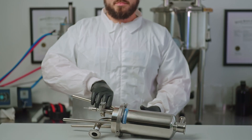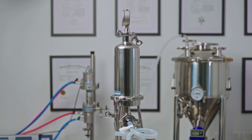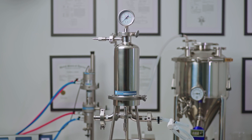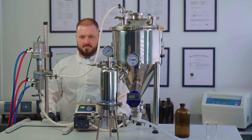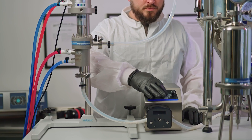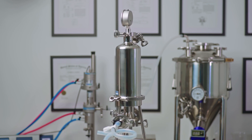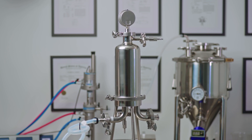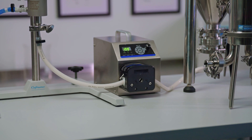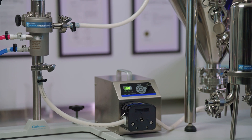In this video we are going to illustrate the procedure for assembling the industrial Sonomechanics large-capacity inline filtration unit as well as filtering a nanostabilizer LSO based nanoemulsion. Filtration through a hydrophilic membrane is an important post-processing step of ultrasonic nanoemulsification which eliminates particulate contamination such as dust, microorganisms, plant matter and titanium particles. The new ISM integrated filtration unit makes the filtering step of the nanoemulsion process convenient and highly scalable.